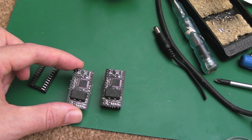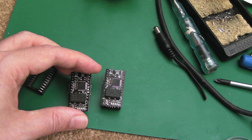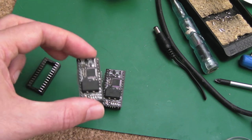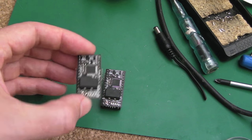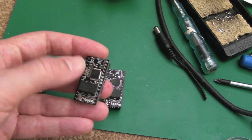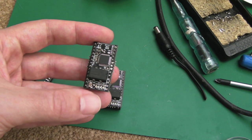You've got clean anti-aliased bandwidth sound at high pitches, undistorted mixed digi tunes, and eliminated volume change clicks thanks to AC/DC separation of master volume register, soft config, so you can actually run a little utility on your C64 and configure this, switch things on and off. I think you can switch individual channels on and off, if I remember rightly. So that's really cool. And there's LEDs on it which intensify, I think they represent the active channel's volume or something. So we'll have a look at that.